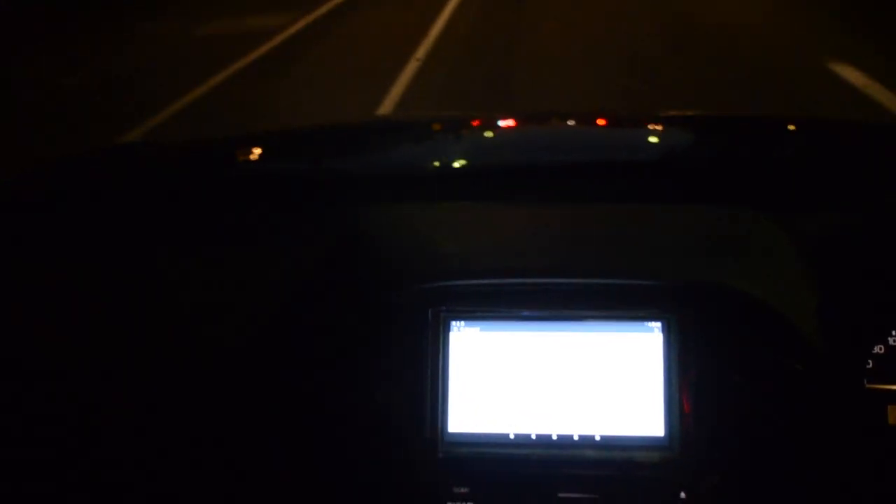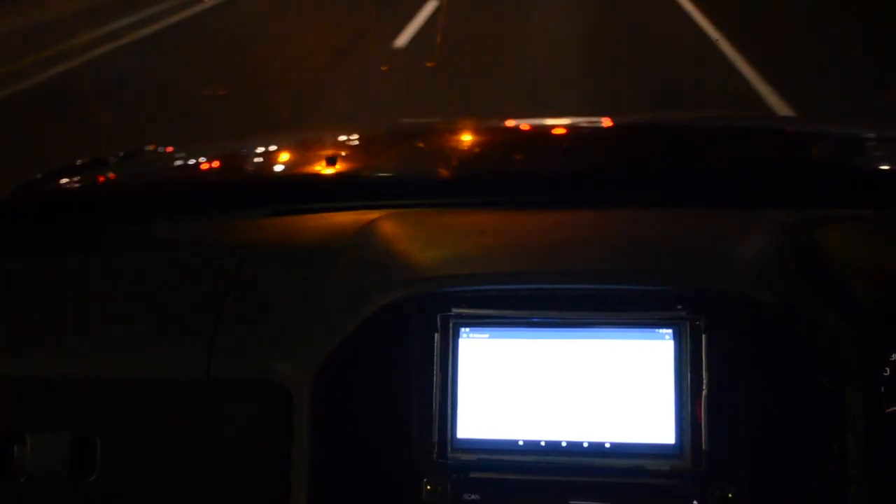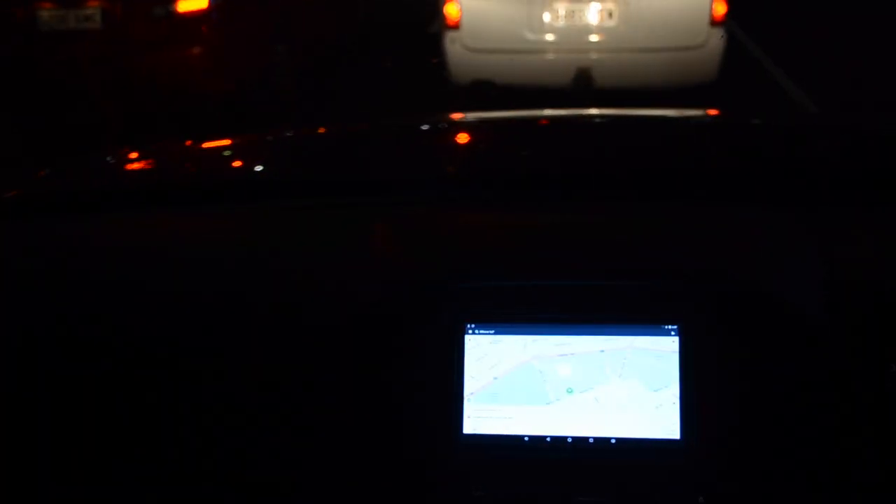Now you might be thinking: why don't you just hook up the Tinker Board to the amplifier so you can use it as a music player as well? Well you can, and if you have an amplifier with an RCA input at the back it's quite easy to do. That way you can receive verbal navigational instructions or run a music player app like Spotify, or do just about anything that you can legally do on Android whilst driving. That's what I did for a short while, but unfortunately whilst I was doing some tinkering I caused a short circuit which blew out a fuse in my car but also took out the audio chip in the Tinker Board, so it's no longer able to put out audio from its headphone jack. Audio over HDMI still works, but I don't think I'll be keeping my slightly damaged Tinker Board in my car anytime soon.